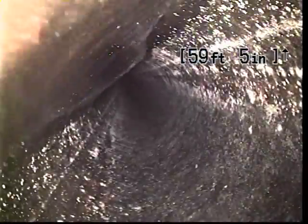This black ABS was in use from the mid-70s all the way to current times, still being used today in the construction of new homes. But it's more than likely that if this home had been connected to a sewer line in 1975, it would have used a cast iron line, not a plastic one. So I don't think that this is the original line. This line was probably installed sometime in, like I said, the early 90s or so.